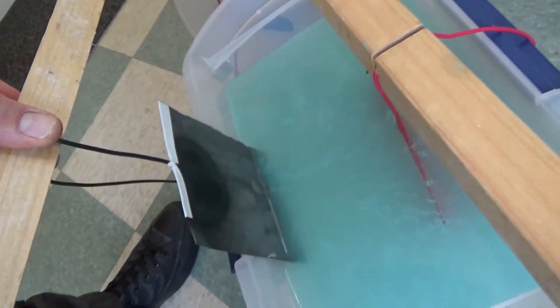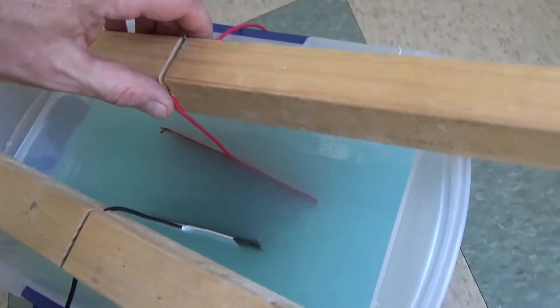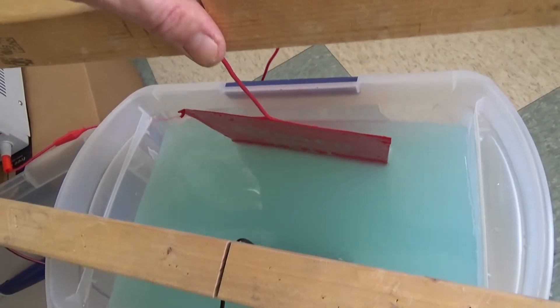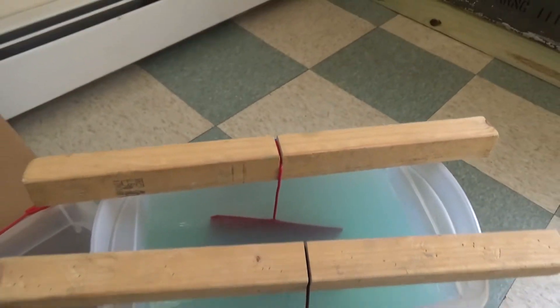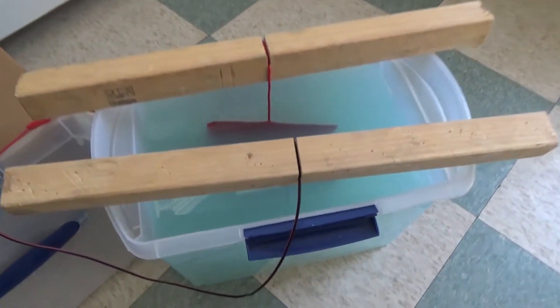Another thing I did today was update the piece of steel on the negative side — nice, clean, and solid. We have a larger test piece on this side. Thinking it's about another 10 minutes and we'll pull it out and check it. It's a nice clean solution and you can see it's already turning blue, so things are happening. We're at the same six volts as yesterday.